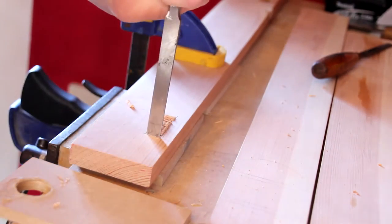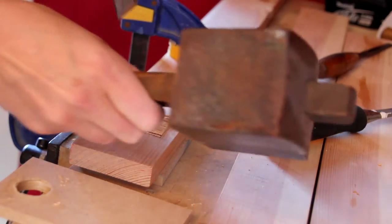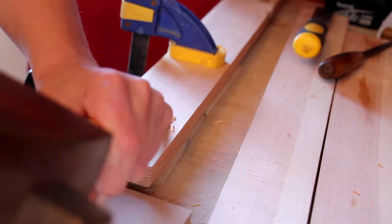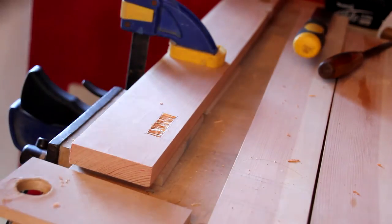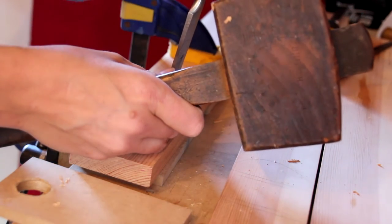These holes will have a little cap on top, a separate bit of wood, which will be glued down with a couple of pins in, so that the bolt head won't lift out, because that'll all be sealed within the wood. So if the bolt was to pop out, there'd be a problem with fixing it back together again, because this is all going to be sealed within the unit.